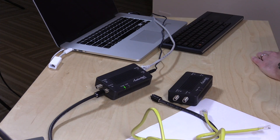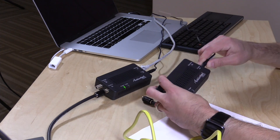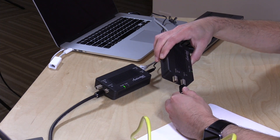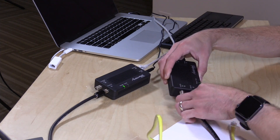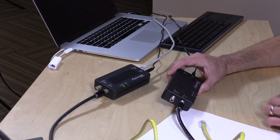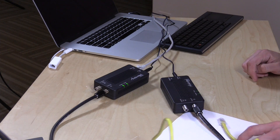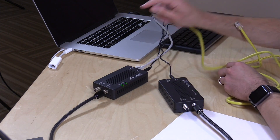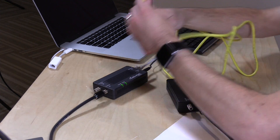On the other end, we're going to pretend this is in the remote room in our house. I'm going to connect power up here and then plug in the cable television wire into this one. Presumably you have a cable television jack in each of these rooms — otherwise you will need to run cable television wiring, and if you have to run that, it might be better to just do Ethernet. You can see here they have found each other already within our virtual coaxial network. The last step is to connect our computer — which will presumably be in that remote room — to this device by plugging in Ethernet into this end.